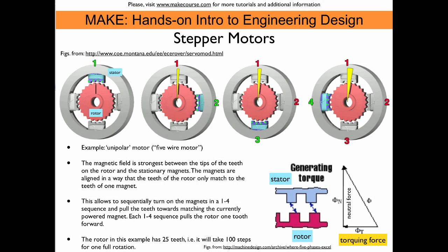So far we have only considered full step mode — where we turn on one electromagnet at a time and each switch pulls the rotor by one quarter tooth pitch forward. Now if we turn on not only one magnet but also the adjacent one, we can turn the rotor by only one eighth of a tooth pitch, because the rotor would settle between the two positions of equal force. This allows half step mode, which gives better resolution. When using two electromagnets at the same time you also get a higher torque, and by doing so in full step sequence, you get a high torque full step mode.